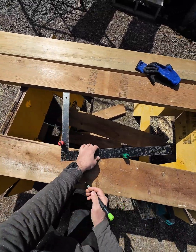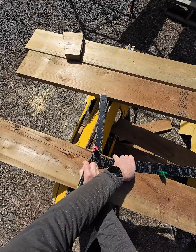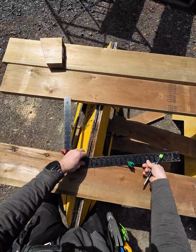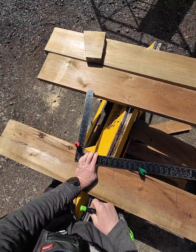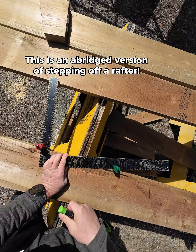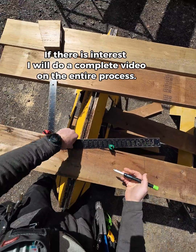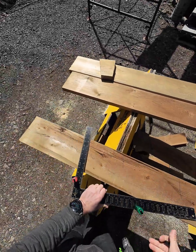That is 24 inches of run, that is 36 inches of run, and then eight — I'm at 44. Make sure you know which scale you're on; that is an eighth. And that is my plumb line.